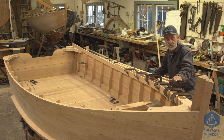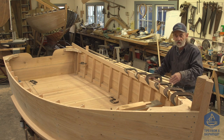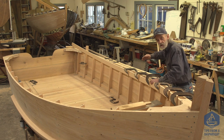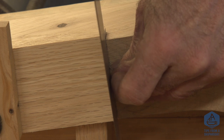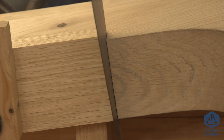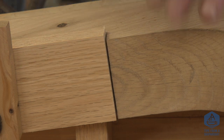The next thing we're going to do is fit it right up to the breast hook, and I'm going to do a saw fit up there. I'm just going to pass a hand saw between the fit up there because it fits awful close right now - rather than take it down and try to trim it with a plane I'm going to pass a hand saw through the cut. Then I'm going to go back aft and bang it up and expect that end to fit really, really nicely. I'll just slug it with a sledge hammer on the other end and that end is going to fit. These saw fits can be a little bit tricky, but this one's not too bad because the piece is fairly broad. The saw dust comes out the bottom so it cleans itself as you saw, and you get to look at it as you go - so you know where to stop.